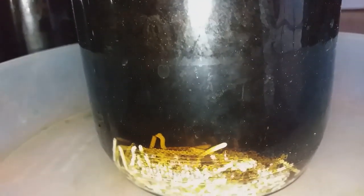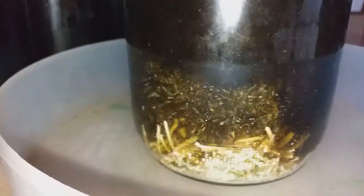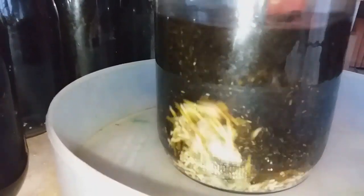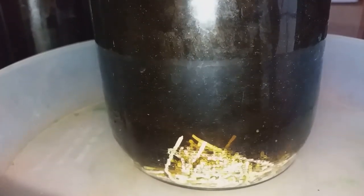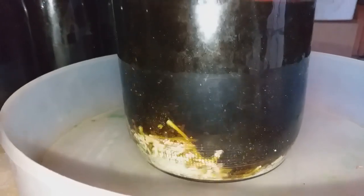See all those little particles inside — this is all silver. What I do every day, at least once but sometimes more, is stir it to break up those partially dissolved pins and remove silver foil from them, and expose more copper to the acid. You need to do that for silver-plated pins — it's not like gold-plated pins at all.